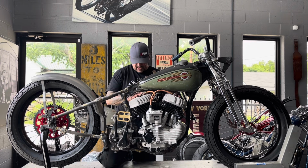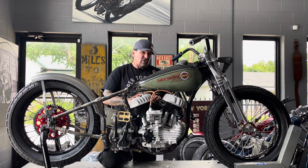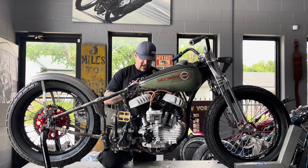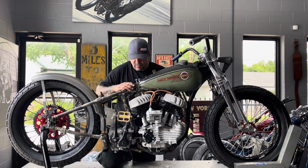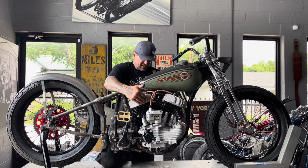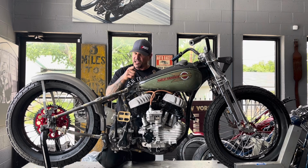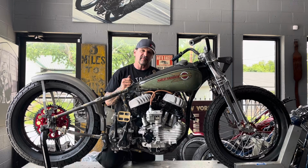And so anyhow, this has got big intake valves, big cams, high compression heads. It's got a big twin carburetor on it. This carb is actually off an Indian Chief. So, you know, if it can draw a big carburetor like this, it's doing a lot inside, a lot more than it was meant to do from the factory. But I'm gonna go ahead and get this thing bolted in. I got a magneto ignition on it. This engine has already been pre-run, so I know it's gonna run. I'm gonna get it in here, get everything set up, and I'm gonna make a set of exhaust pipes for it. Stainless exhaust pipes, 2-in-1 with a collector, so this thing will really draw some horsepower.